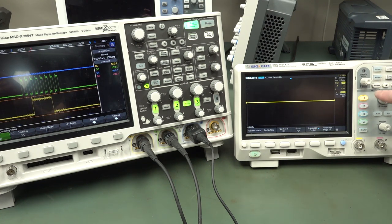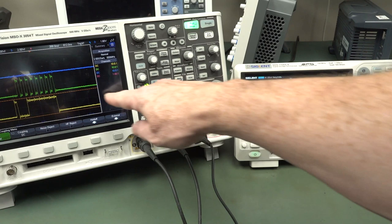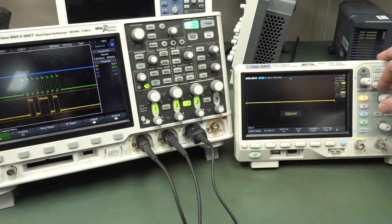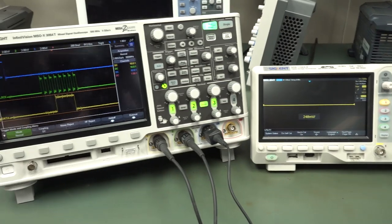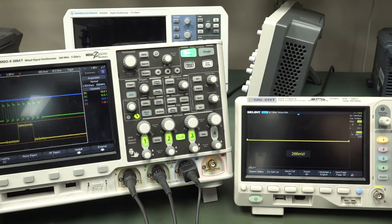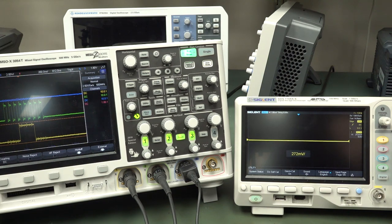What we want to know is: when we press the vernier for fine adjustment mode, what happens? The data is updating every time — 494, 482 — it's jumping, it's changing. It's definitely doing something. It really is changing that data with every step. It looks like it's increasing by probably 1 dB of gain for each vernier adjustment. There are some combinations where it doesn't change at all — it's gone, well, I don't need to change the range.